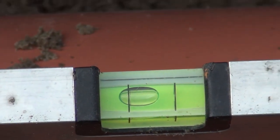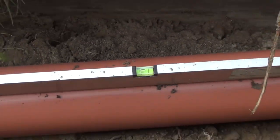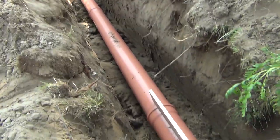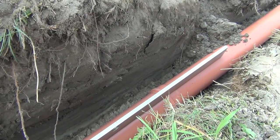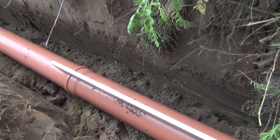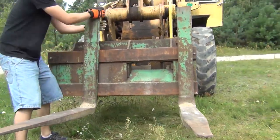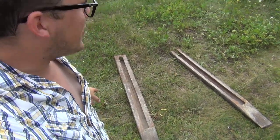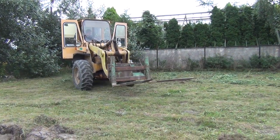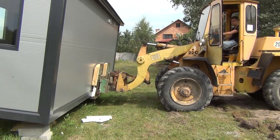That 2.5% decline is just from experience on the house. I'm going to check every connection and make sure that if your bubble level is longer, you put it on the two joints and it's not resting on the pipe, because that will throw off your measurement. My neighbor is here with the forklift and we're going to move the container — these extensions will help us get a better grip on it. It's up in the air, but I have to help the neighbor navigate.